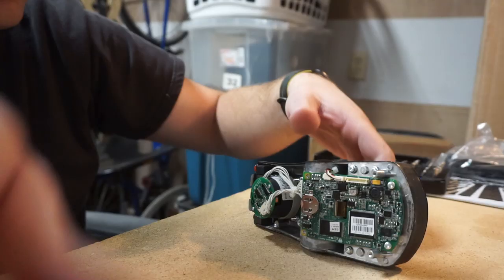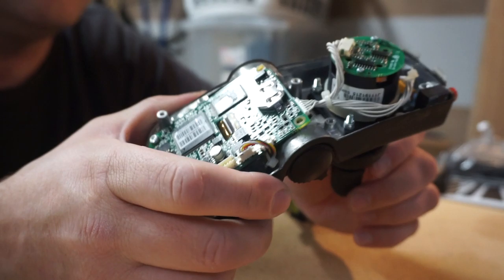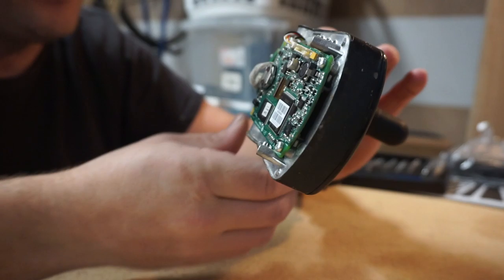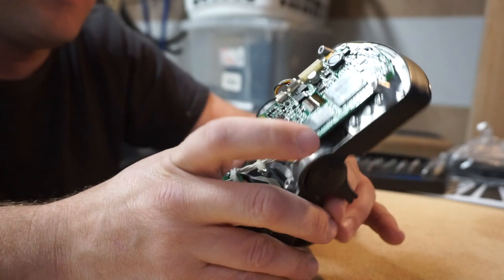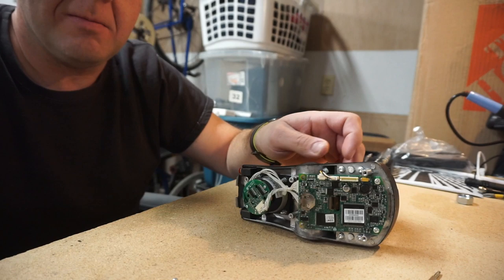We've got some different designs here even from the R-Net stuff. The joystick gimbal looks to have four magnetic coils inside of it — you can see them poking through. It looks like they might be using a slightly more robust version of what Permobil uses — just a single magnetometer — to detect deflection. There are also some little processing ICs on there. The input mono jacks have their own little daughter board connected with a separate harness.